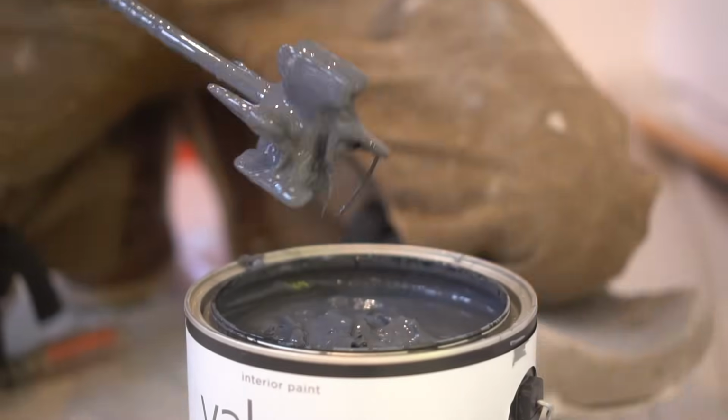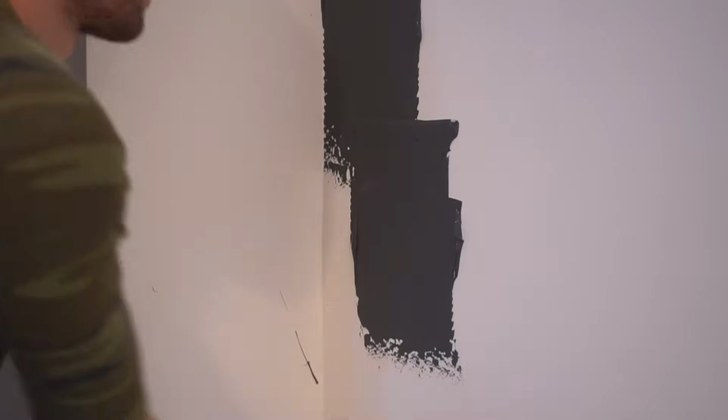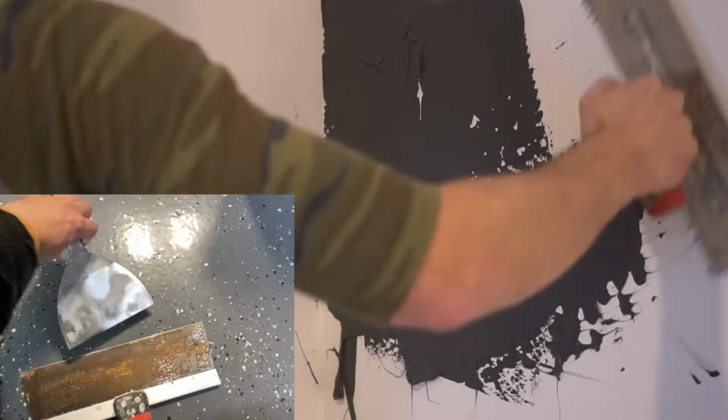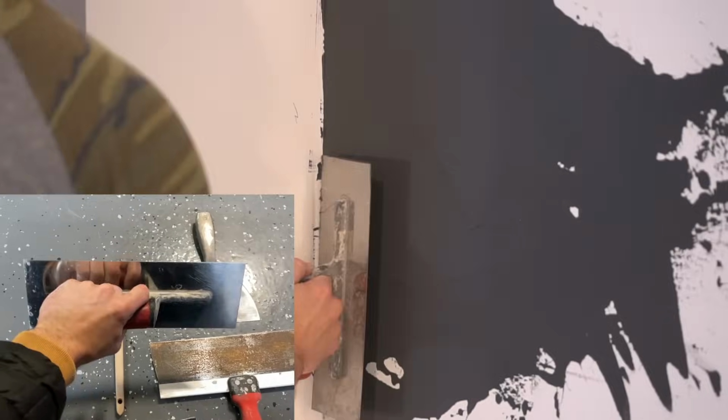That's why I use a drill as well as a mixing paddle, because otherwise my hand would be cranking on this for a while. When applying this product, the tools are really one of the most important parts to keep in mind. Specifically, the tools that I use that are the most important on this project is 1, a drywall mud pan. 2 would be a 12-inch mud knife. You have also a 6-inch mud knife, a painting brush if you want to get into some of those tight-knit corners, as well as a finishing trowel, which really helps allow you to spread the product evenly as well as polishing it in the end.